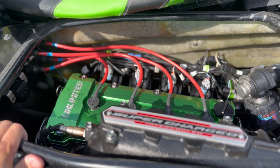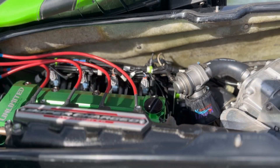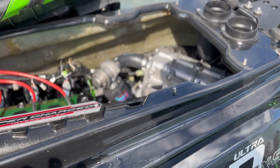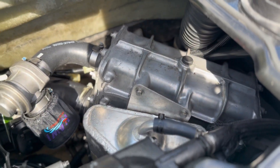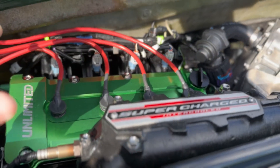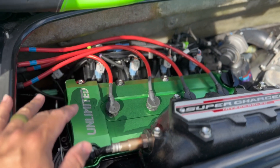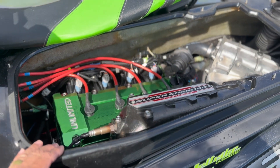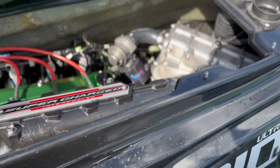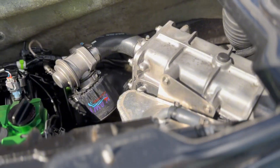This machine isn't just about getting the highest straight-line top speed — this is about extreme durability in a heavy-duty saltwater environment. Just from looking at this, you can see that every single bolt on my exhaust system and on my engine has been upgraded to Grade 5 titanium or 316 stainless steel, and this is going to ensure longevity of the hardware and of the engine itself.